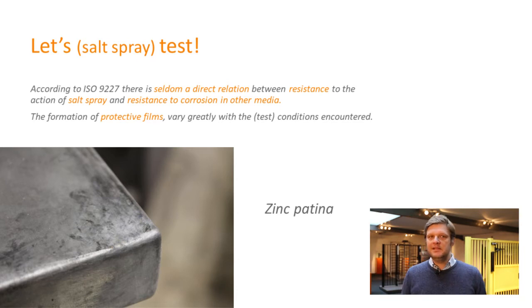An interesting one is the zinc patina. What is that zinc patina? The patina begins to form as soon as the zinc coating is exposed to the atmosphere. It's a natural protection film that develops over the years. That is also why hot dip is the best option — besides the hot dip treatment itself, you have the zinc patina that gives an extra layer of protection.